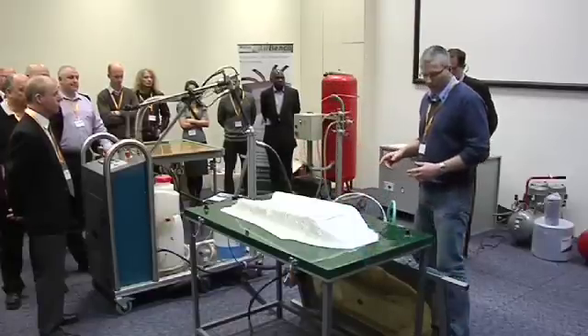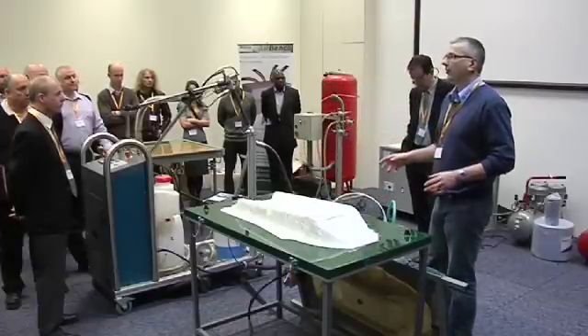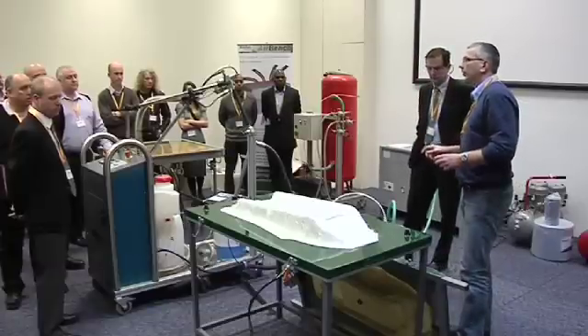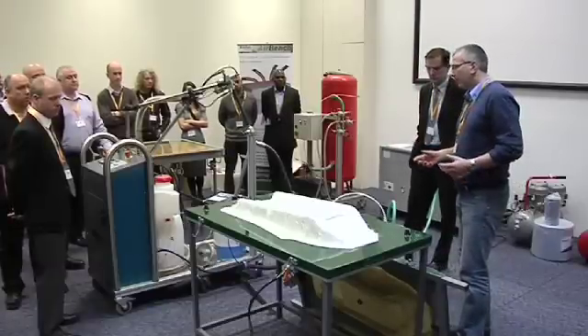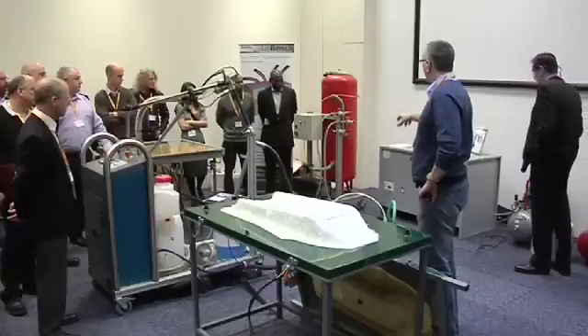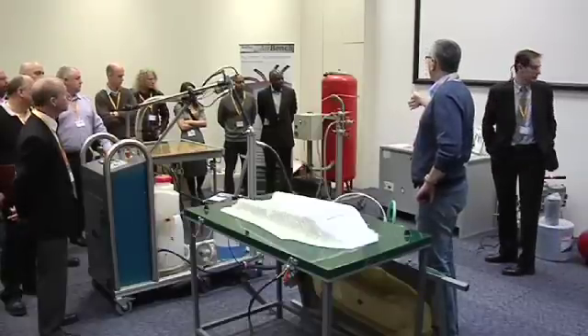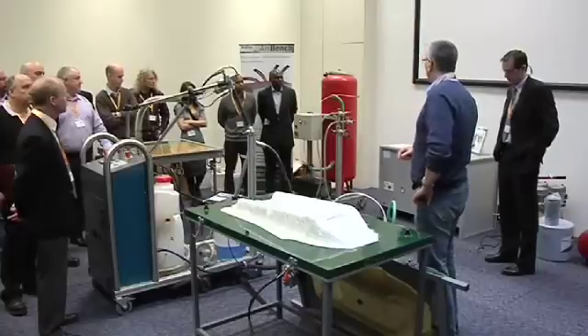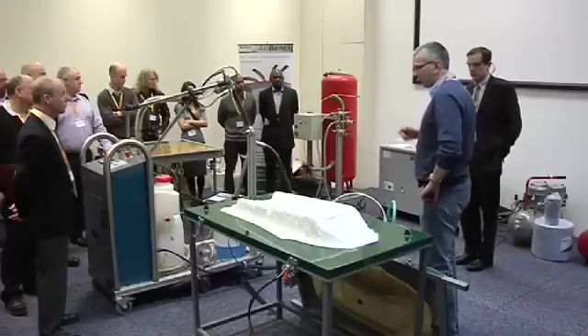That's really important — we control that because we're actually holding this tool closed with vacuum. We're not mechanically clamping it; the toggle clamps you can see are basically just to get the seals into contact in the first place, and once those are in place the vacuum will hold the tool shut. The vacuum pump in the corner is basically the opposite of a standard compressor — there's a little vacuum pump and a reservoir, and the vacuum pump switches on and off until the reservoir is at the appropriate vacuum level, giving us a permanent store of vacuum.